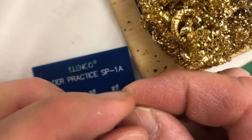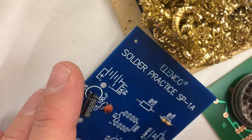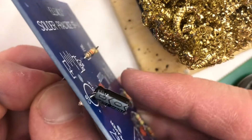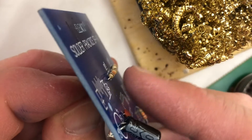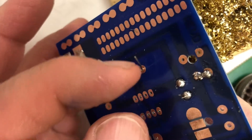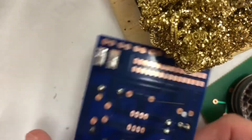I'm going to bend it gently like a horseshoe first, then make sure the gold stripe is to the right. Whenever you see the font on the resistor, turn it so the gold stripe is to the right. I'll slide the 10k resistor in and pull it from the other side until it's flush on the bottom. They can stick up a little, but you want them mounted flat. Flip it over and bend the leads like old TV antenna wires — it'll hold itself pretty steady.